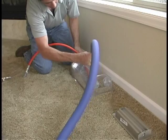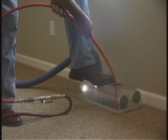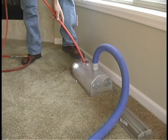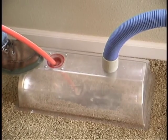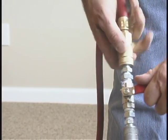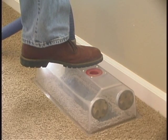Take the one-and-a-half inch vacuum hose and insert it into the opening on the vacuum box. Then, while keeping the vacuum box tightly pressed over the register opening, fully open the air valve and begin slowly retracting the cleaning hose out of the duct. You'll know that you're cleaning effectively when you see dust and debris swirling inside the vacuum box as you slowly withdraw the cleaning hose. You may wish to invite the homeowner over to see the process during this phase of the cleaning — they will be amazed at the amount of gunk coming out of their ducts. When the duct ball comes into view, turn off the air valve, disconnect the cleaning hose from the quick connect coupler, and gently pull the ball through the red grommet while holding the vacuum box steady on the floor with your foot.